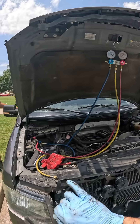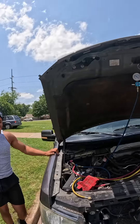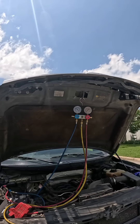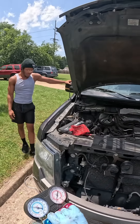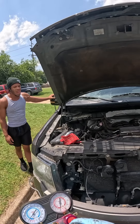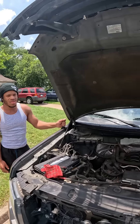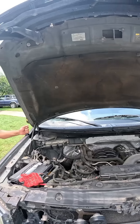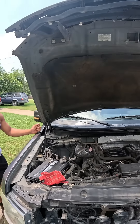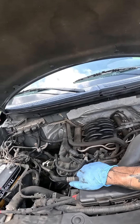I don't think it's toast? Well, it might be toast. I would recommend replacing the compressor — I couldn't get it to turn on and we've got plenty of juice. It did leak out some. It sounds like it's leaking out, maybe back there. It was a little over 40 and now we're down about 32-35. I recommend replacing that compressor. You also have a leak somewhere that needs to be addressed. I've had to replace those little O-rings before — they leak.